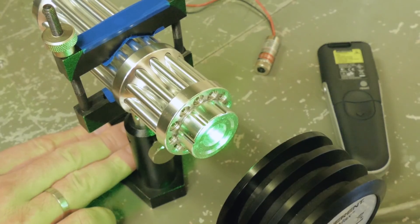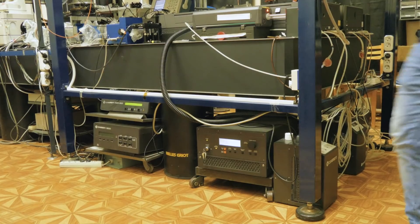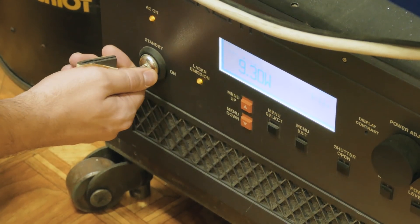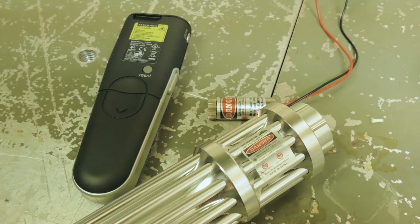At 95mW, the laser must be keylocked to prevent unauthorized use. There must be a laser beam indicator and a mechanical shutter to obstruct the beam in case of a switch malfunction — safety precautions similar to a 10W bench laser. However, there is a two-position switch on the lightsaber, which is more dangerous than a laser pointer's single button. Let's pretend you switch it on and it falls on the floor — would you close your eyes and try to find it by touch? The seller included goggles in the box, but they don't fit tight enough, and through those gaps you could easily get blinded by light spots.